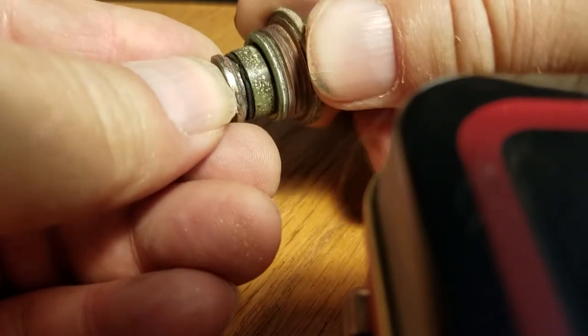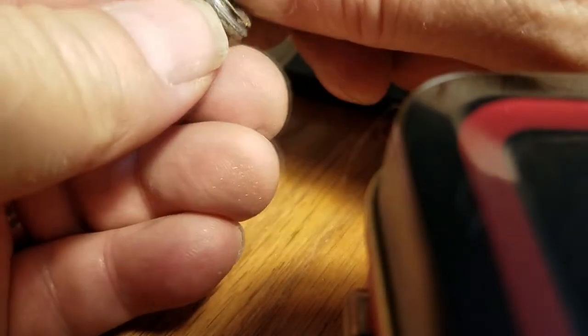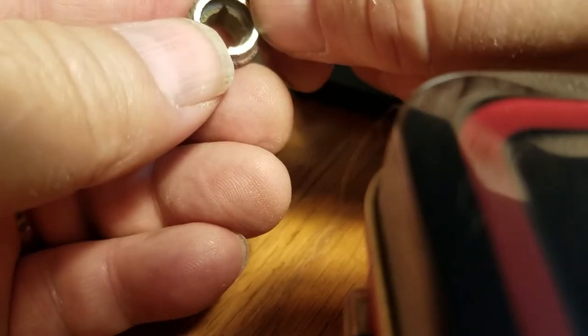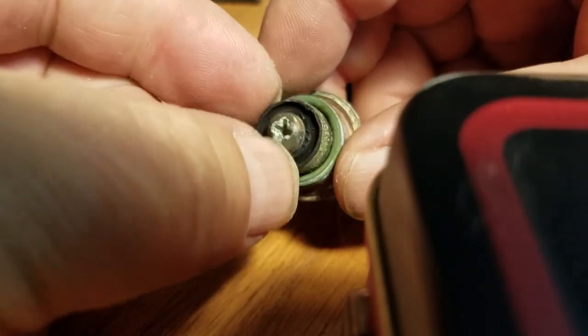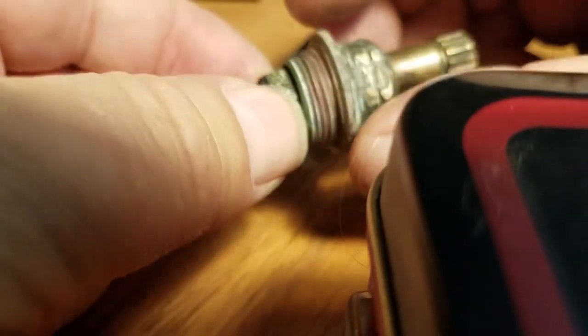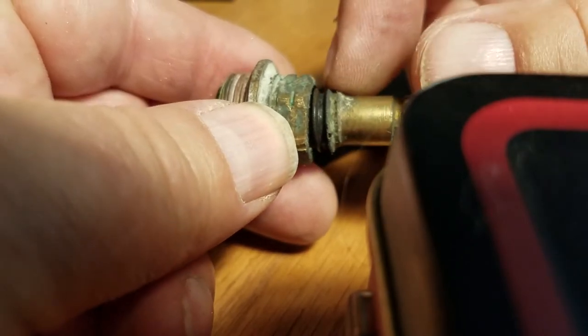All you have to do is replace the little rubber gasket, and you have a good seat again. It'll last you a good long time — usually I've had to do these once every five or six years for these old faucets. I think the rubber seats they make nowadays don't last as long, but they're still good. I like to put some plumber's grease on the valve threads.